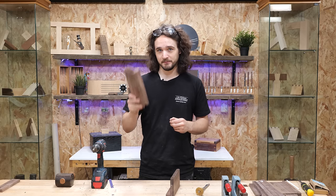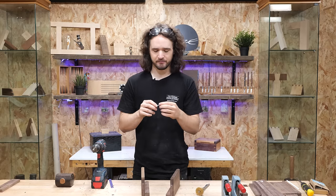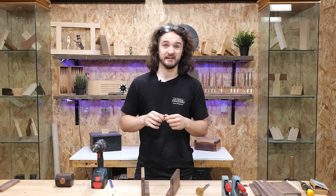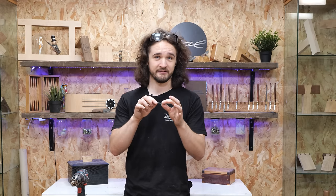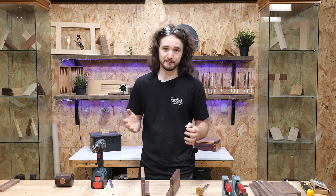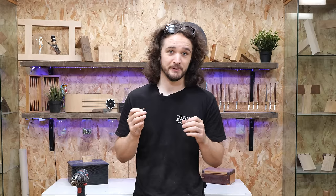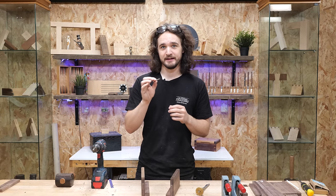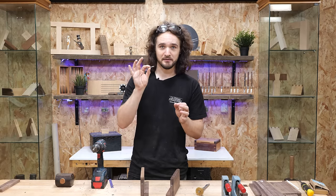However, if you're not confident about the placement of the drawer runners and want more adjustment, the method we're going to use is threaded inserts. These get a bit of a bad rep in fine furniture making because bolting something together is seen as a bit barbaric, but in this case it's going to be completely hidden, nicely recessed, extremely functional, and because we've got such a strong joint we won't even need to glue it — so we always have room for future adjustment to get that drawer fitting perfectly.